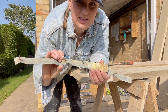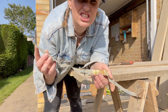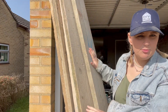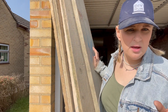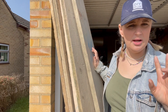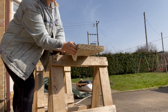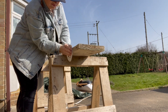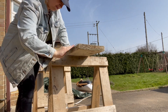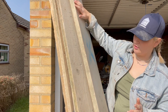Just be careful — these bands are so sharp and can cut you to pieces. So I have all the scaffold boards with the bands taken off, ready to be stuck together. Before I do that, I'm going to sand down with an 80 grit — just the sides that are going to be glued together — just to give them a bit more of a smooth surface, because there's bits coming off. It'll just be easier to smooth it down first.